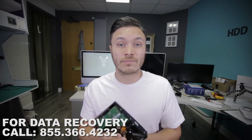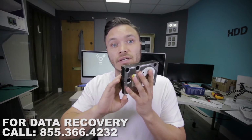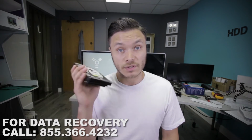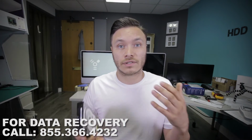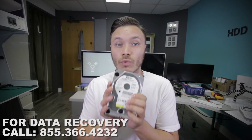You just have to rebuild the ROM from the service area if this unit doesn't spin, but I'm suspecting this drive actually spins. It will let me read the ROM information, read the ROM modules, find a donor PCB, and write the ROM from this unit into the donor PCB, as well as the modules for the ROM from this PCB, onto a donor PCB that doesn't spin the drive down when it begins to read. The problem with this device is that when it spins up, as soon as I hit read or image, it snaps into a clicking sound. It starts powering up and powering down, doing a whole bunch of hectic things, which is very typical for the Tornado family when it is no longer working.